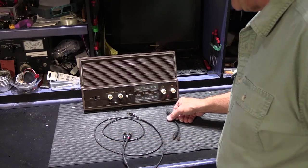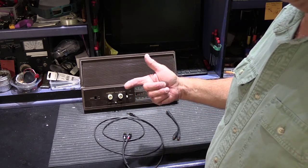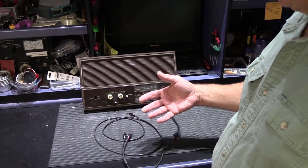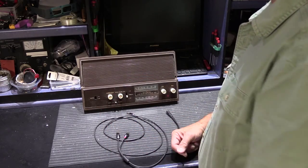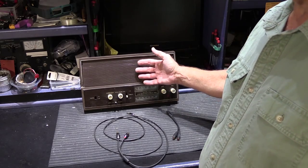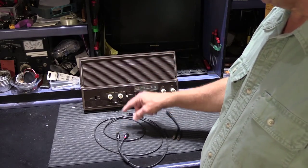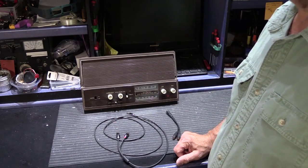And what you have to remember is your iPhone, any smartphone, your iPod, a CD player, your satellite radio, all of those devices are stereo devices. They have right and left channels. Well, NuTone Intercom systems, except for a very, very few rare exceptions, are monaural systems, which means you don't have 2 speakers in each room, you only have 1, and the right and the left channels are combined together and they play together through a single speaker in each room.